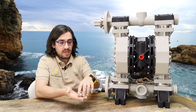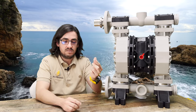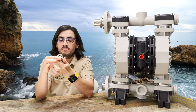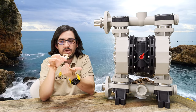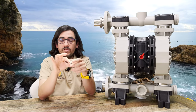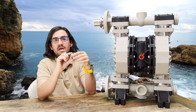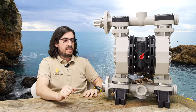Every time it does that, a normal diaphragm pump has a cage, a ball, and a seat — one here, one here on a normal pump. Not this one. This is a flap valve. Every time the diaphragm oscillates — remember there are two diaphragms, a rod, and four of these — the little balls go up and down thousands of times every minute. You have that potential of trichomes getting crushed against the cage and against the seat. This pump avoids that problem entirely.